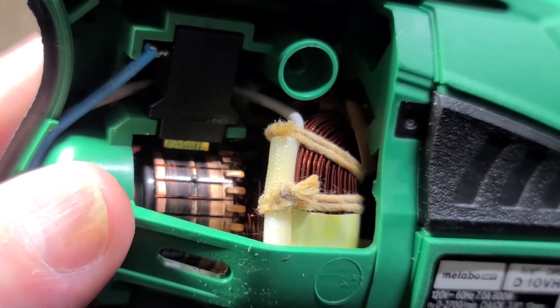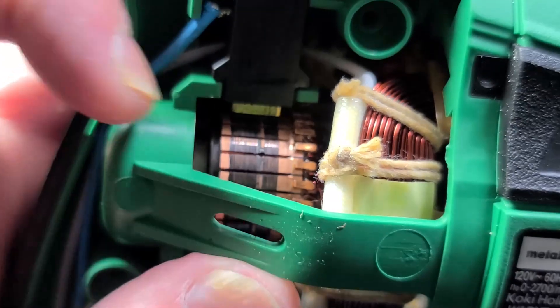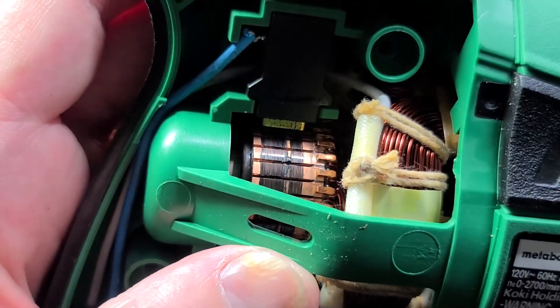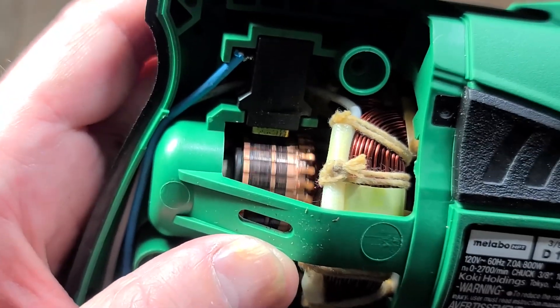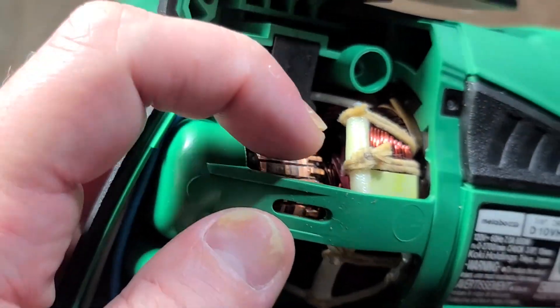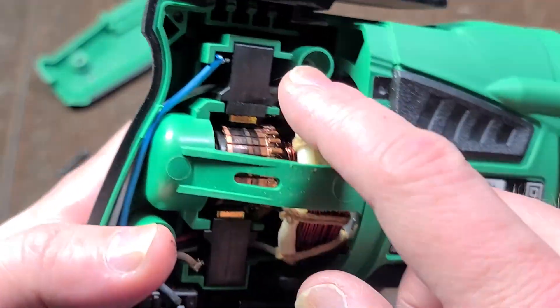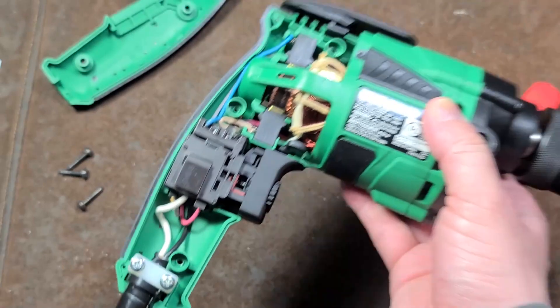As far as the motor is concerned, we can see that it has narrow bands on the commutator — that means it is a higher-speed motor. There's some kind of little defect there; that could have been a piece of carbon that broke off and got caught in between those two bars and etched a little hole in there. That's pretty rare to see something like that. The motor doesn't seem to be skipping — normal folded contacts dipped in varnish. Nothing really too special to talk about there; it seems okay and normal in there.